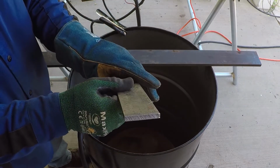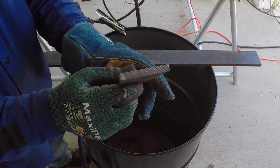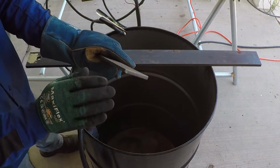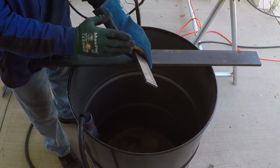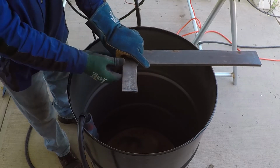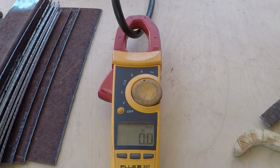This is quarter inch, about 6.3 millimeter. If you remove the slag, the cut looks beautiful, and it's way faster than using the grinder, even though it's struggling on 120 volt. Cutting the quarter inch flat stock on 120, 50 PSI, and the machine set to 55.